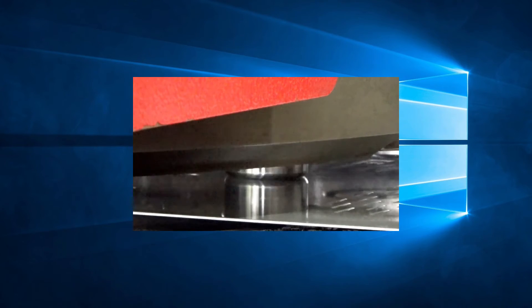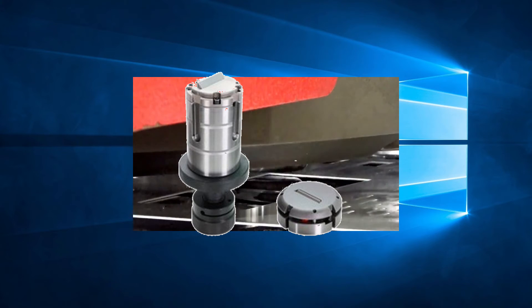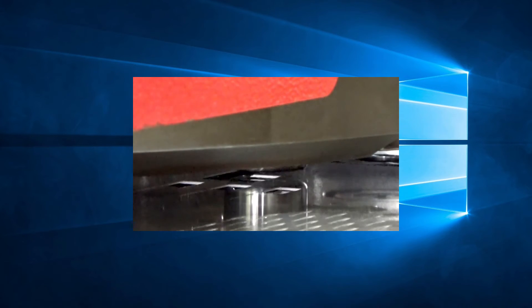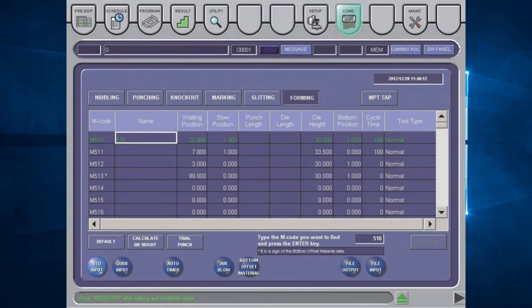Another advantage is for forming tools. In the past, when a forming tool was purchased, the operator would have to test the punch on a particular thickness of material. By adjusting the height of the tool, this would adjust how far down the tool was pressed by the RAM. Of course, this would have to be redone if the material thickness varied. Starting with the Vipro series, setup time was greatly reduced. An operator could choose an M-code specifically for that tool and enter all setup information for RAM movement on the control. The M-code for that tool would then be specified to the programmer. No longer a need to change the tool length or use any shimming.